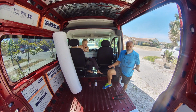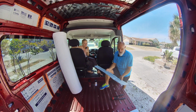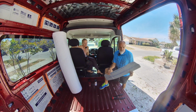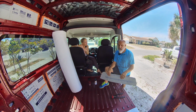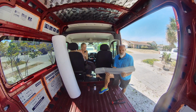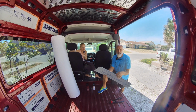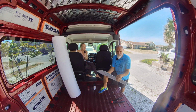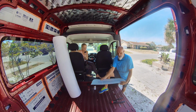So I've got two products that I'm using to insulate the floor. One is actually used for exterior siding on the wall. When they're building a house and you drive by and see the plywood wrapped in something, this is what it's wrapped in. It's only a quarter inch thick, which gives an R value of 1.25. This is laying down first, and it's a water barrier as well.